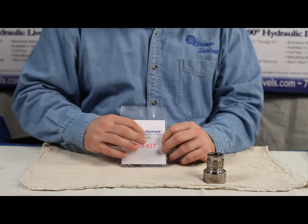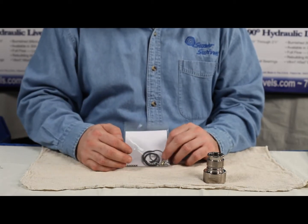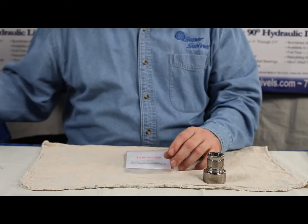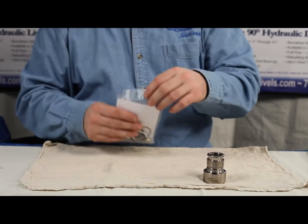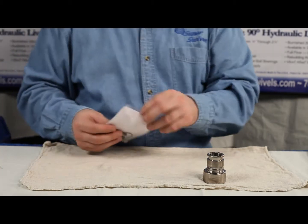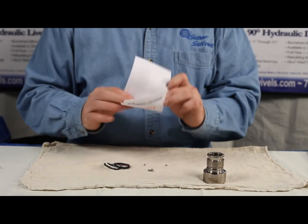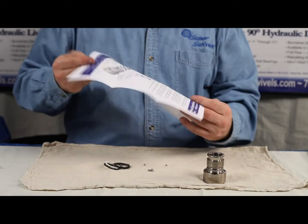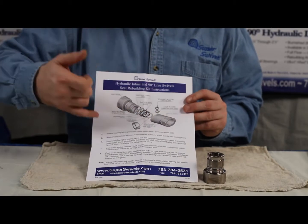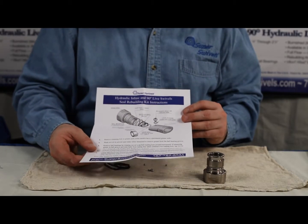This shows the size and the kind of seals we're dealing with. If you flip it over, you can see all your seals, a bolt, a washer, a zerk, and some balls. I'm just going to go ahead and cut this open and dump everything out. This is our instruction sheet — it has a little diagram of all the seals and how they go on, and a brief description of how they go on. It's pretty informative; you definitely want to give that a read-through before you try to rebuild it.